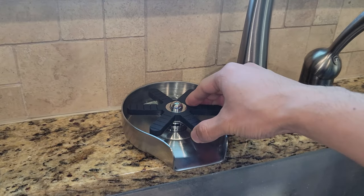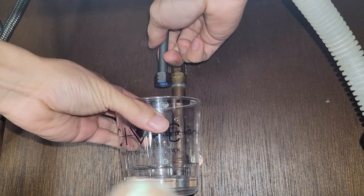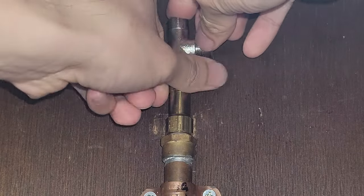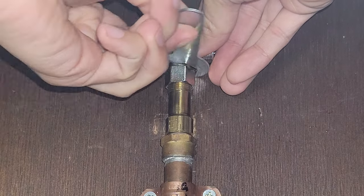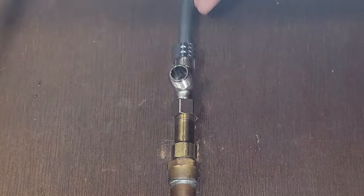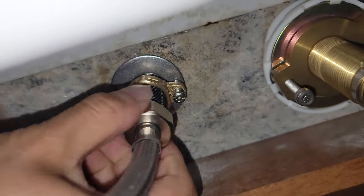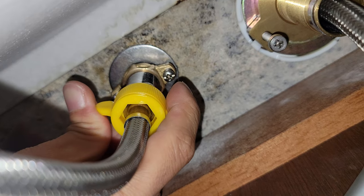Then place the washer and actuator over the nozzle. With the water line still shut off, remove the sink faucet's hose from the water line, and be ready with a cloth or cup to catch any water that may run out. Now install the T-adapter, making sure the rubber washer is installed in the nut prior to connection. The washer will be sufficient in creating a watertight seal, and plumber's tape is not required. After the nut is finger tight, you can secure it with a wrench. The top of the T can be repositioned after tightening. Reconnect your faucet's water line at the top, then connect the supply line's small connector to the side valve on the T, tightening it with the yellow tool. Finally, connect the large end of the supply line to the bottom of the rinser's shank and use the yellow tool to tighten fully. Be careful not to over tighten, as this can actually lead to leaking.